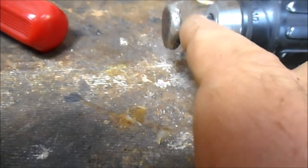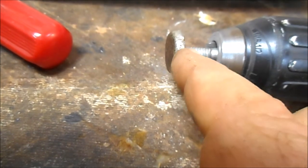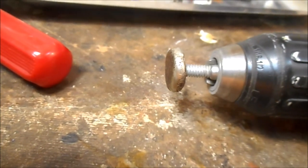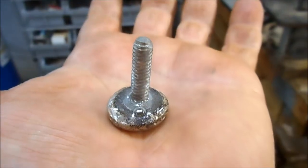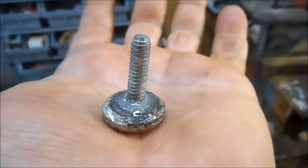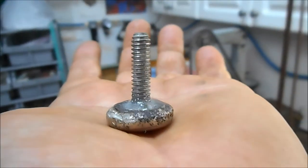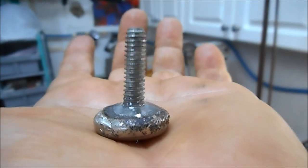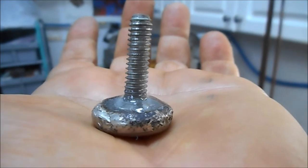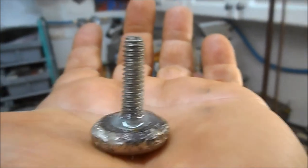I found a quarter-20 bolt in my supplies, threaded it into the drill, and spinning it on the drill I put it up against the grinder and took the hex off of it - now that will fit right in there. I'm going to epoxy that in there, then put a rubber washer over top of it so at least it looks like it belongs. No one's ever going to notice it's been changed. This quarter-20 bolt will thread into the T-nut that we're going to replace it with. I mixed up some five-minute epoxy, filled that up, and when that sets up it'll go right into that T-nut.